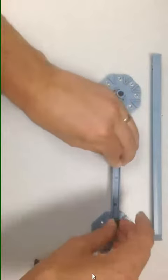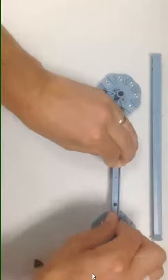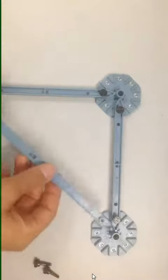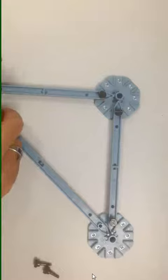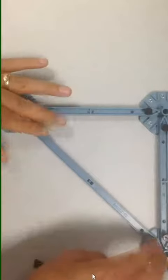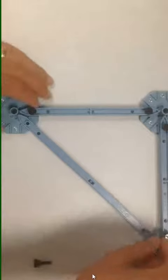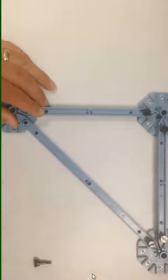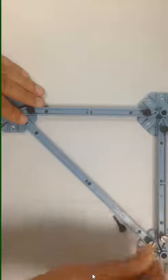Again putting the pin into the recess for the middle of the connector and affixing it in place with the screw. Now we will attach the hypotenuse of the triangle, the number 5 member, and connect that across. For any 45-45-90 triangle, these will be made of two connectors of one number lower than the hypotenuse. In this case we have a 4-4-5; the next size down would be a 4-3-3, and then the size below that would be a 3-2-2.